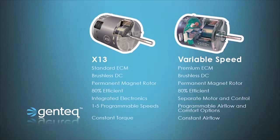One other difference is on variable speed motors, you can replace the motor separately from the control, whereas in the X13, the control is actually integrated up into the motor shell. And on variable speed motors, the manufacturer can actually program the exact amount of airflow they want for heating and cooling or even dehumidification functions, whereas in X13, you just have five speeds or five programmable torque taps.